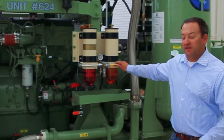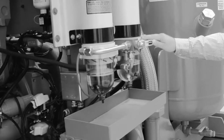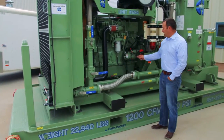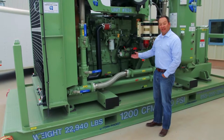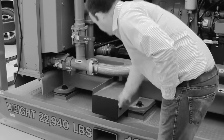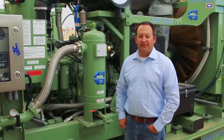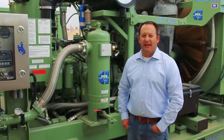We've also featured a RACOR fuel filter system to provide superior fuel filtration, allowing you to change filters on the run while the engine is running. You can isolate the system, change a filter, and never shut the engine off. One of the nice features of our skid is everything is sealed in the containment area — you can wash it and drain it out. It allows you to clean the unit and offers superior environmental protection. We cannot spill oil on the ground with our skid designs. The CLS 1200-350 features the IR 2.5 HR air end, a superior design with years of trusted service in the oil, gas, and energy-related fields.